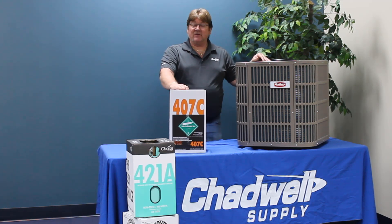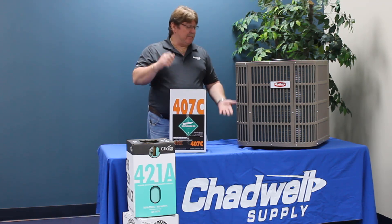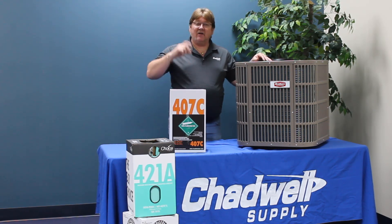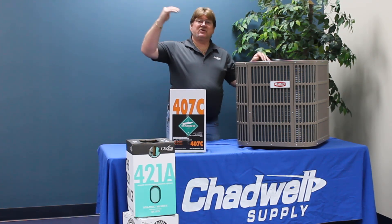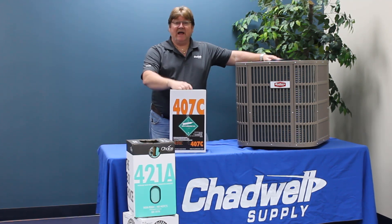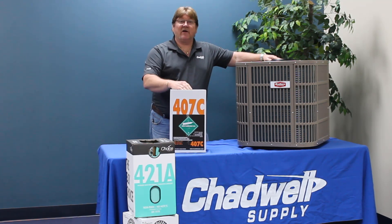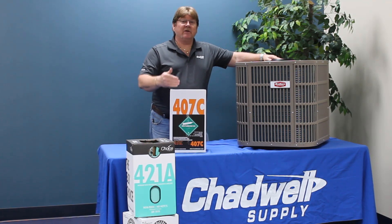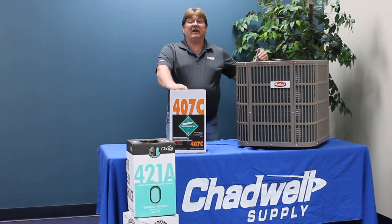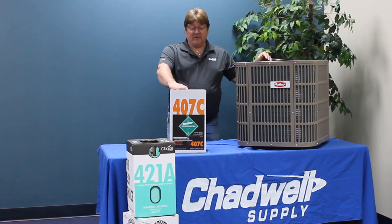That's the reason for the oil change. When we change the oil, you take the compressor, cut it out, get a measuring cup of some sort, pour it in there so that you can measure how much you took out. Once you get it all out, flush the compressor as well as flush your line sets and flush the evaporator with an approved flush kit to the outside. Make sure you catch any residual oil — don't spray it on the ground for environmental reasons. It's your oil, it's your waste. You own it. Find a place that accepts recycled refrigerant oils and don't mix it with any other oils.